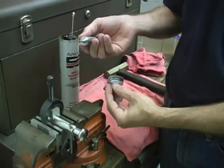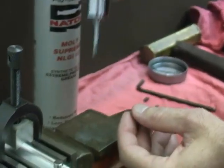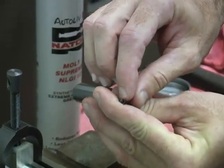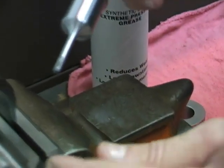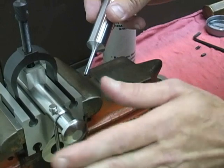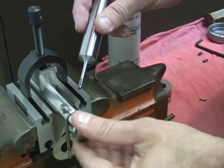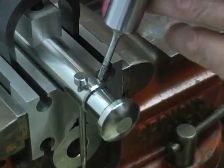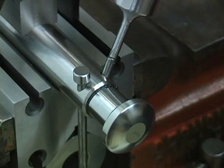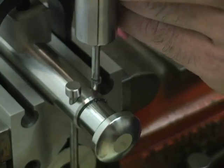Put a little grease on the pin driver so that it can hold the pin and the pin won't fall off. There are slots in these pins — make sure the slot is towards the outside of the punch body. You don't want the slot up against the rotating head, or it could scratch or burr up the head and cause it to stick. Put the pin driver at a slight angle when you drive the pin in for the first couple of hits, get the pin started, then straighten it up and drive it in the rest of the way.